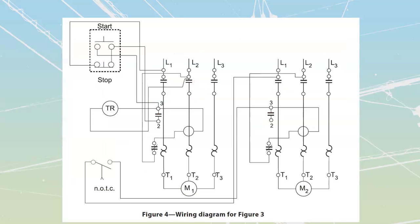There's another timing diagram for this one. This one over here is using a timing relay, by the way. That is one of our pneumatic or hydraulic types of timers. Those are ones where we provide power to the coil, and then it either has to force air or force some type of silicone fluid to operate. We, at this point, don't see a ton of this stuff.